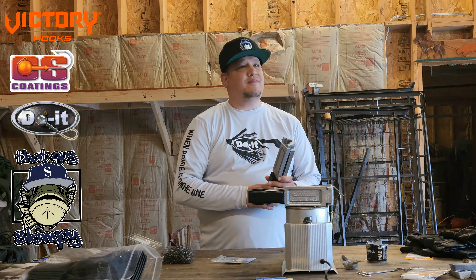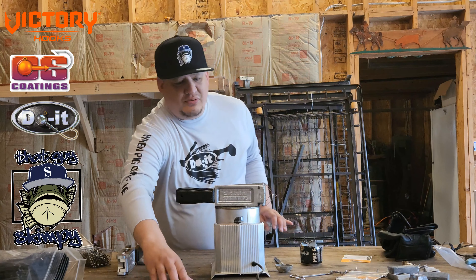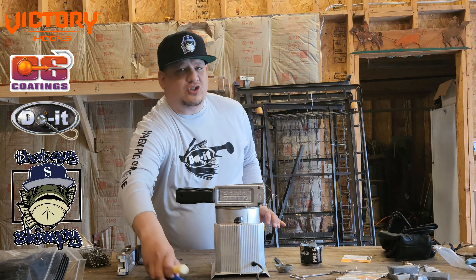So then you have it open so you can just put the blade on. Right now we have the molds sitting on the pot and they're going to get hot — you want the molds nice and hot before you start pouring. Another thing we do is what we call smoking the mold. The reason I do that is it helps lead enter the mold and it also helps you release the bait from the mold.